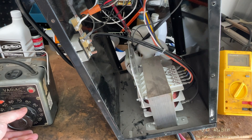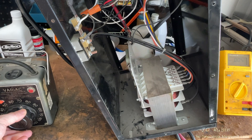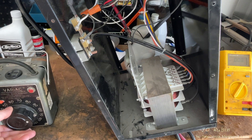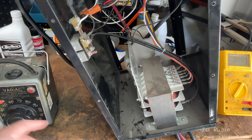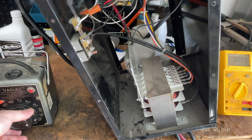I've reconnected the negative side of the secondary windings for this test. At 120 volts, the fan is spinning, there's no hum, and there's no apparent problem. Obviously there's no output because nothing's connected to the rectifiers, but that's clearly where the problem is — from the rectifiers back. My bet is it's the rectifiers.